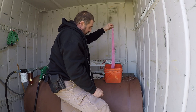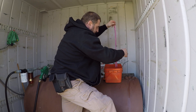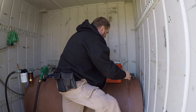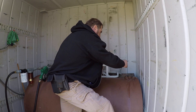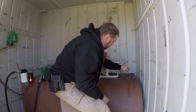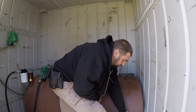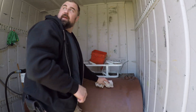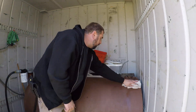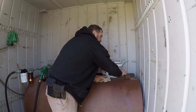These things work great. There's a fiberglass rod inside that basically just drops down inside the tank. I'm going to put it back in the tank because there's no need to pull it out unless it's completely swelled up. I do treat all my fuel with Sta-Bil diesel treatment. You want to tie it off with not too much slack so it doesn't interfere with your pickup tube on your pump. I give it an extra four inches and it lays flat on the bottom of my 300-gallon fuel tank.